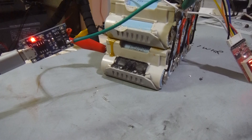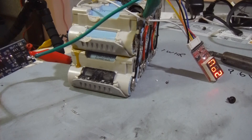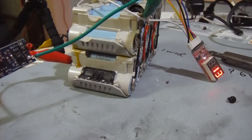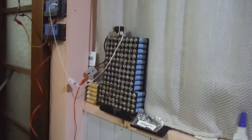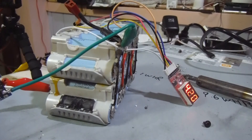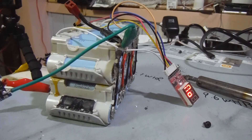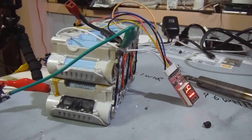So number one should boost itself up now. We'll do number one first, then change it to number two, and get them to bump themselves up. That's a quick solution when you don't currently have a LiPo charger — to recreate a bit of balance. This will also come in handy for making sure cell packs are topped off. I believe that big bugger up there is probably out of balance by now — I'll have one of the cell loggers on it. Put the little TP on one of those while it's cycling up and down and we'll be able to get it back into balance. Cheap — these boards are a dollar each, alligator clips probably a dollar, USB cable two or three dollars, and a USB power source you've probably got lying around. You're probably watching this video on a phone that's plugged into one. That simple.